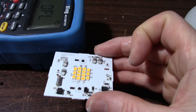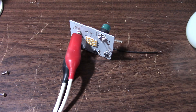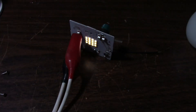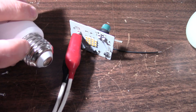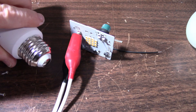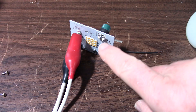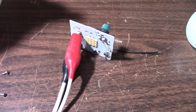I'm just going to hook this up to power and see what happens. I've hooked it up to mains voltage — I don't want to touch it because it's live. I have it hooked up to a bulb limiter. I screw in the bulb and it works. There's nothing wrong with that. That's strange — why was I getting a connection? When I screwed it into a socket at my house it did not work, and it did not work at my parents' house. Maybe when I tore this apart I pulled on a wire that got loose. But there is nothing wrong with this bulb — it works fine. It could be a solder joint, but I didn't see any problems on the board. I think it had to have been a connection issue.